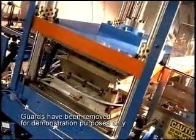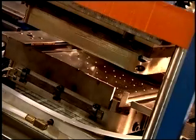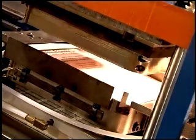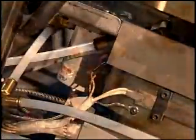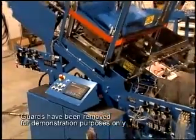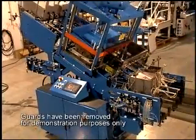Before the blank has actually reached its resting position against the stationary blank stops, the platen has begun its travel downward. The draw pad portion of the female die engages the paper against the lower draw ring, which is held in an extended position by air cylinders or compression springs. As the press continues to descend, the paperboard slips between the draw pad and draw ring and forms around the male punch into the female cavity.